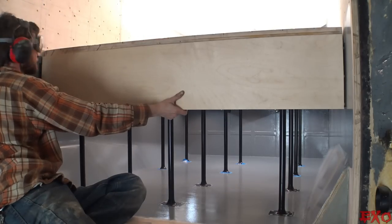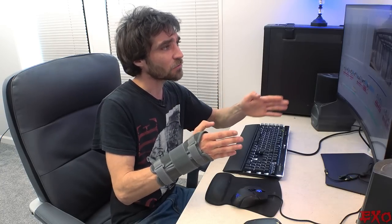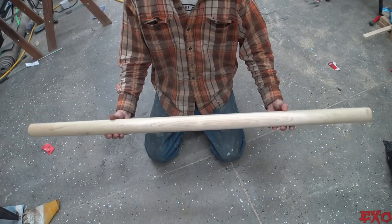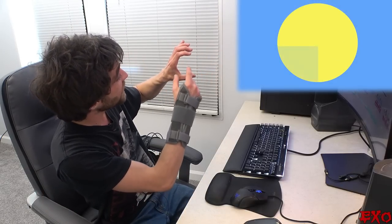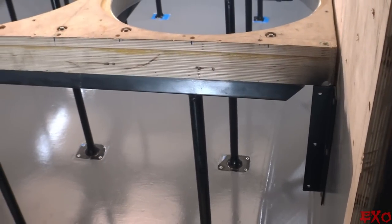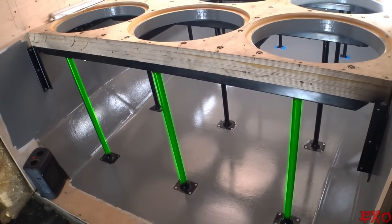Decent fit. Yep, it's fitting in just fine, but we're not out of the woods yet. I want to add a little flare on the end, and I think I've got a good solution that checks all my boxes: a large wooden dowel, surprisingly strong too. If you take the profile and notch out a section from the center, it creates a convenient little flared end when joined up to a flat panel. Plus, we get the bonus of the round over on the other side shimming up flush against the vertical braces.